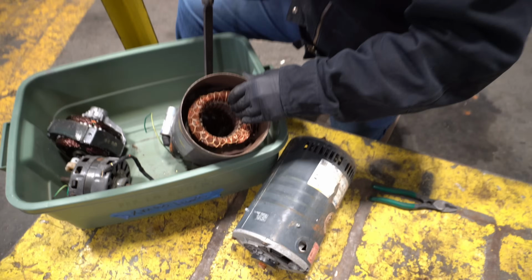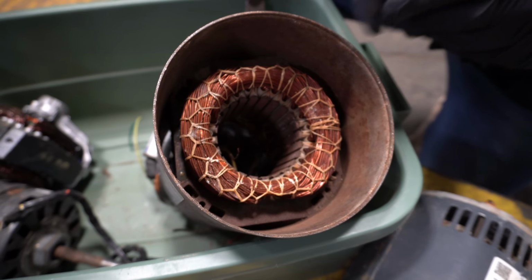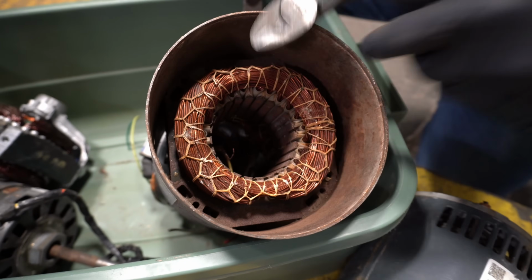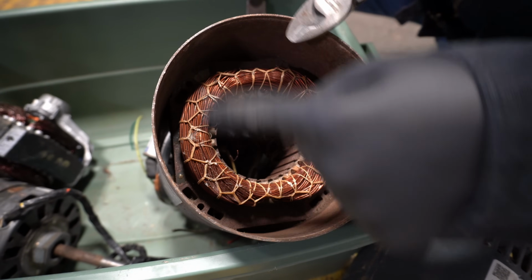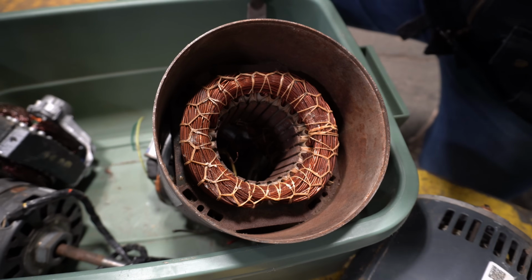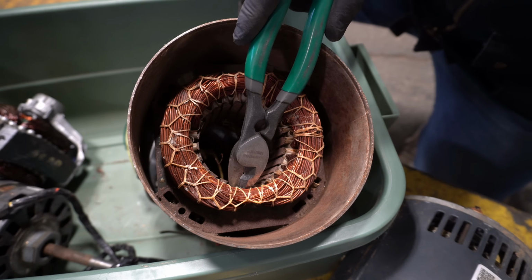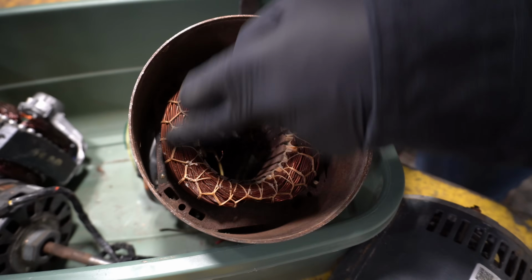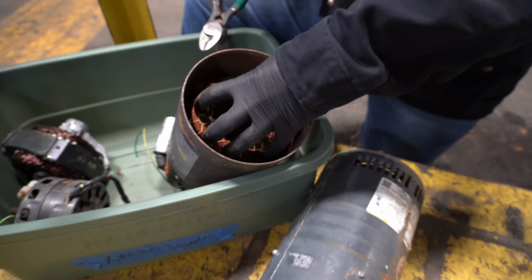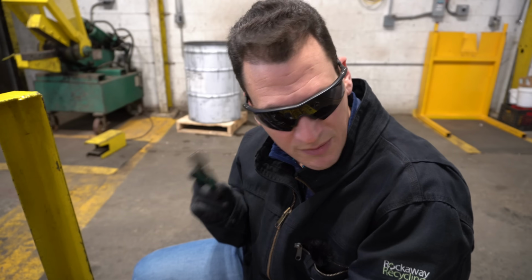When you have an electric motor and you pull the rotor out of the middle, a lot of guys will use snips or they'll use sawzalls. They'll be able to cut this circle out around, and then the other side, all these spinning pieces that go around, they go through and then they can pull that out. Some people use vices, some people use different types of tools, but you can easily take this after you pull the armature out, because you can see here it's spot welded inside, so you do need to separate. It takes a little work, but this could be a piece of copper that comes out. You get about 3 to 5 pounds of copper out of this and the rotor. So that's just something to keep in mind.